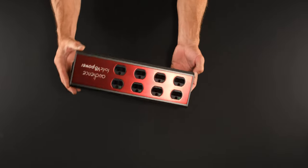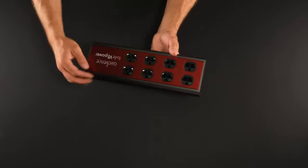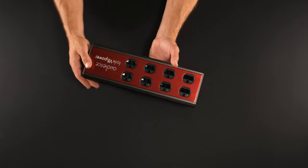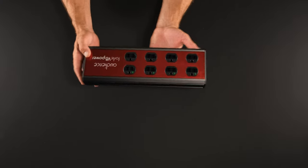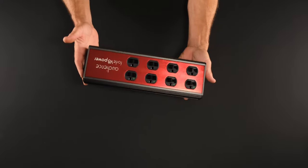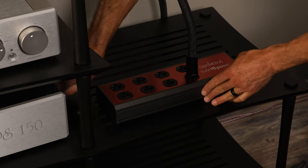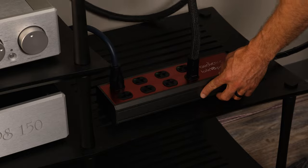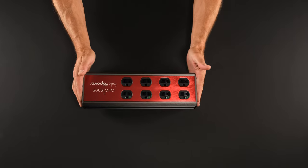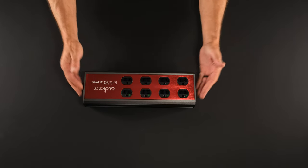The V8 feels substantial as it should, and it features the green dot of hospital grade outlets on its four parallel duplexes. That's a really good thing in high-end audio because without the solid grip that hospital outlets offer, modern audiophile cabling and connectors will sag in the outlet and offer a higher impedance for a high current connection than we want. Grippy is good.